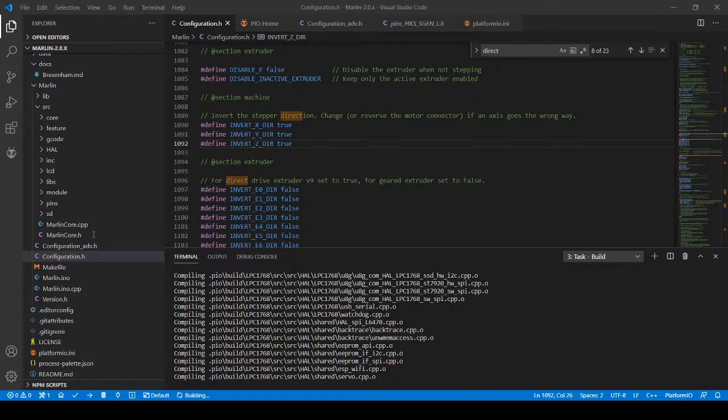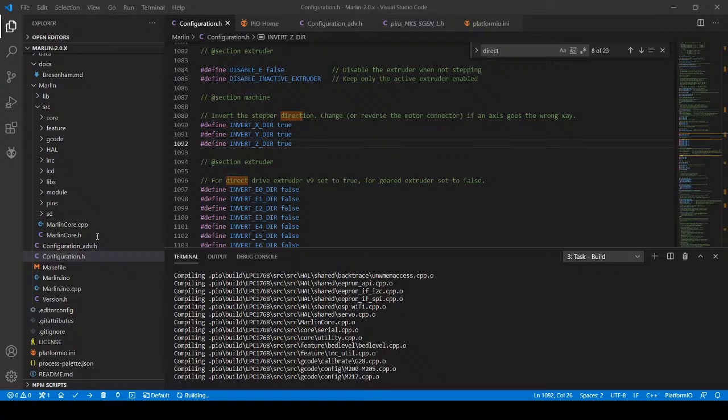Yeah, for the Big Tree Tech 2-in-1 mixing hot end, those parts, that's the mount that I'm using. Just remember to keep an eye on it, because if your temperature goes crazy, it'll melt through the mount. Maybe one of these days I'll have time to actually take the design and make it out of metal, but right now I don't have any metalworking equipment that's big enough to work with. Meaning I can't cut thick metal with the tools I have.